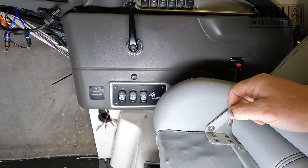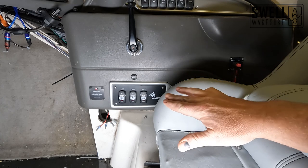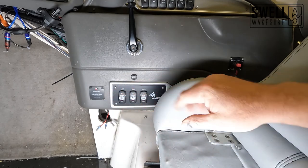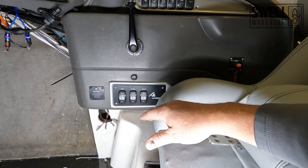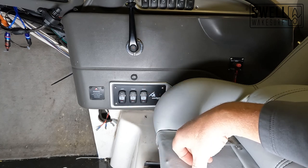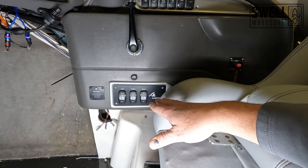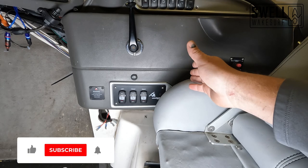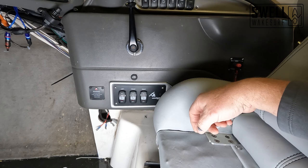We pulled all of the existing stock wiring out and went with the fat sack wire harness kits, which include these fat sack switches. We have left, front, and right just like the factory in the same placement, but replaced everything with the new wire harness kits hooked up directly to the batteries. This ensures a cleaner install — no tracking down sprinkler valve wiring. It's easier to pop the switches out, swap the new ones in, get everything plugged in, and go. That wraps up the ballast system in this boat. Thanks for watching — make sure to like and subscribe to follow along as we keep moving through this Supra.